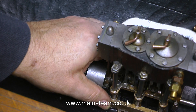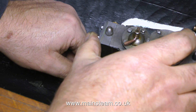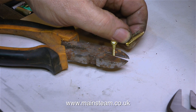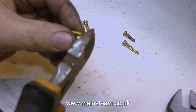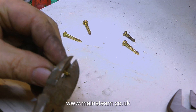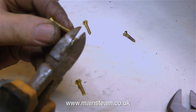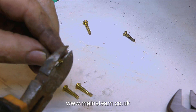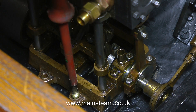In this clip I'm double checking that the engine is accurately positioned over the mounting holes in the hull. The engine was originally held in place with some countersunk screws — you can see one of them on the bench. I automatically assumed the four countersunk wood screws were this length for a reason and I didn't want to go any longer in case longer screws came out of the bottom of the hull. In the workshop I have a tin full of really nice domed head brass screws, so I just shortened these: nipped off the end, ground them back to a point on the bench grinder, and they fitted perfectly.